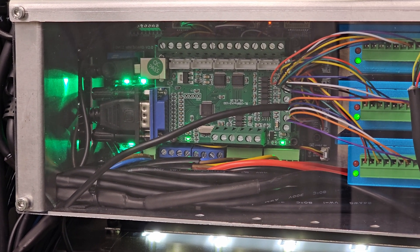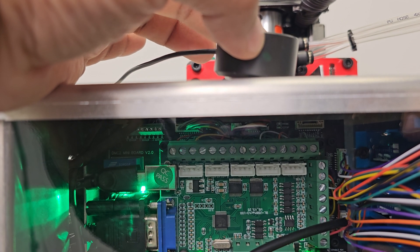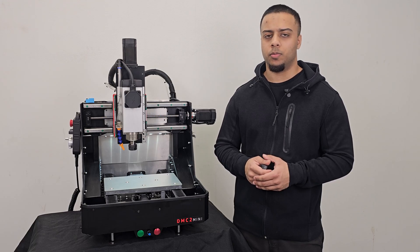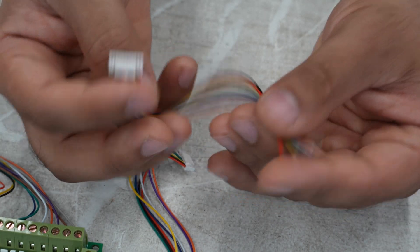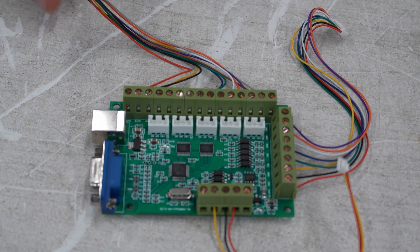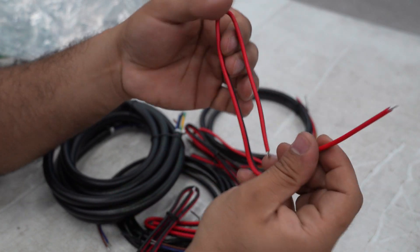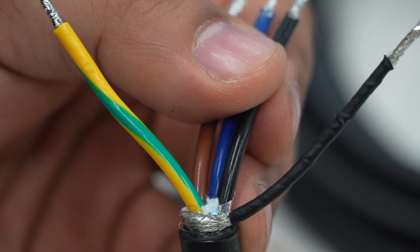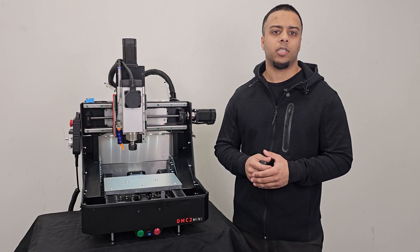We don't usually see problems with the DMC2 electronics, but there is always the chance for human error when connecting and wiring things up yourself — maybe 1 in every 100 people who are building the kit might cross a wire or swap two things accidentally. Before, that was annoying to track down with a multimeter, but now it's as clear as just an indicator light to show if something is not where it should be. All of the low voltage electrical wires are pre-stripped with pre-made connectors, and all other wire for the power supply, spindle, buttons, etc. are all pre-measured, stripped, and pre-soldered, so you just stick them where they need to go and screw them in. The spindle motor uses high-flex double-shielded and grounded oil-resistant cable, intentionally routed separate from any low voltage signal wires so that electrical interference is not an issue.